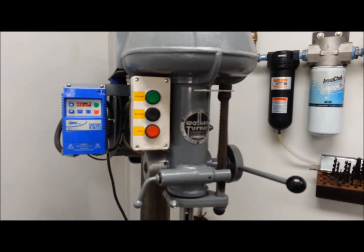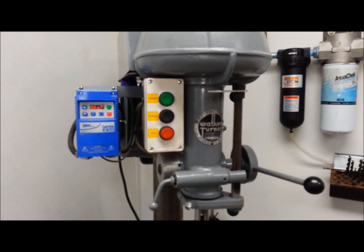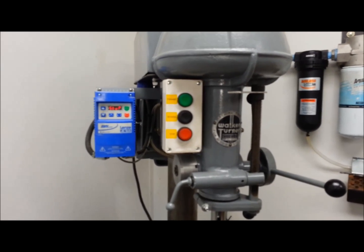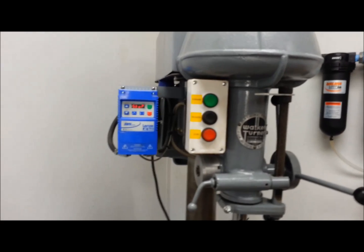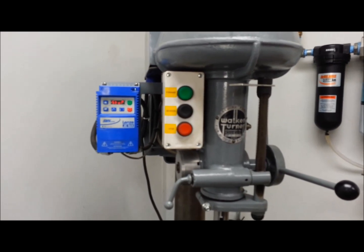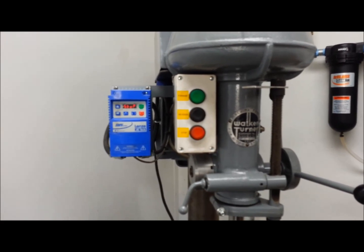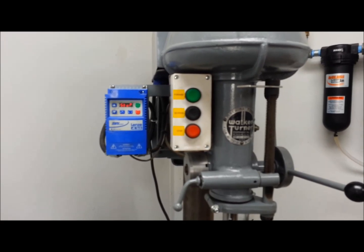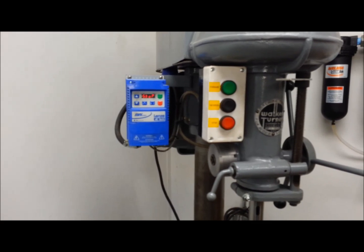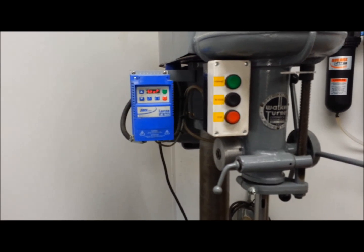Let's talk about motors and the difference between two-pole and four-pole motors. Typically a two-pole motor is a high-RPM motor, usually in the 3000 to 3400 RPM range. If you try to slow it down too much you get a phenomenon known as slip — you've only got two poles to drive within that motor, so there's more chance of slipping and you can't get the torque out of them. With a 1700 RPM base motor you're working with a four-pole motor, and there's less chance of it slipping at lower speeds.